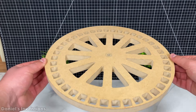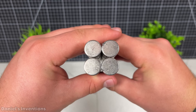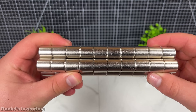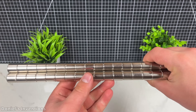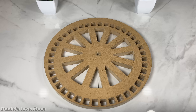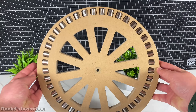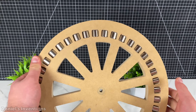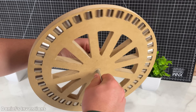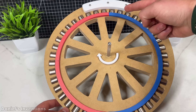I designed a rotor that is 13 inches in diameter. I have 40 neodymium permanent magnets that will be installed in the rotor. They are 5/8ths of an inch by 5/8ths of an inch with a pull force of 42 pounds each. The permanent magnets are installed so that they are offset in relation to the center — on one side they are extremely close to the end of the rotor, and on the other side they are further away.